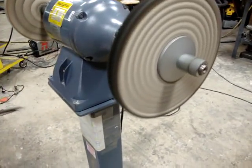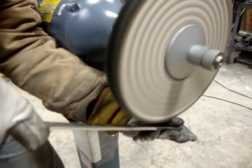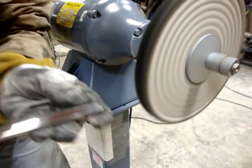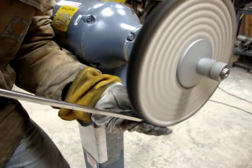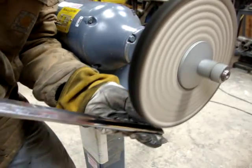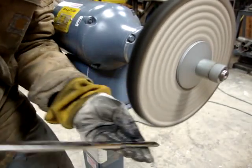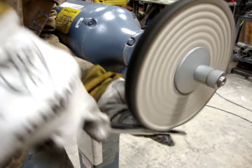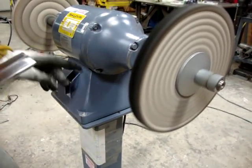Never put the trim in leading-edge first. When you do have to do corners, just do the inside and then flip around and do the outside — so you're basically polishing like two halves. Now I'm going to go into a finishing stroke. I finish every wheel like this; this way I get the cleanest finish possible. It's like doubling up the effect of the wheel.